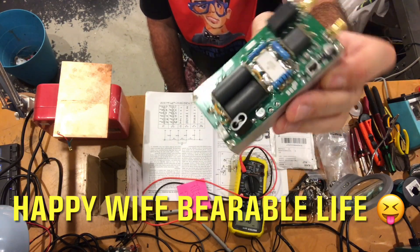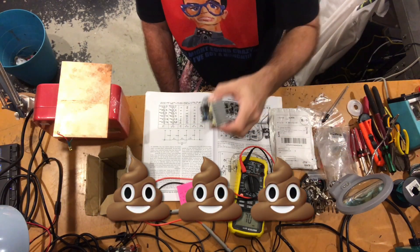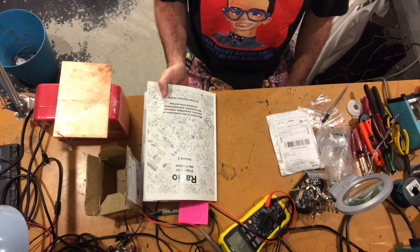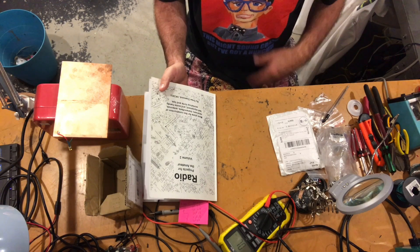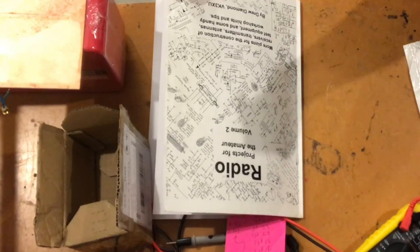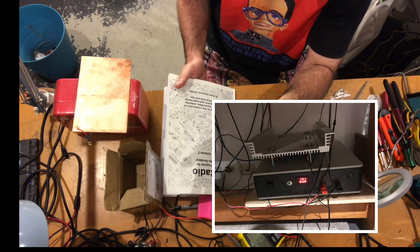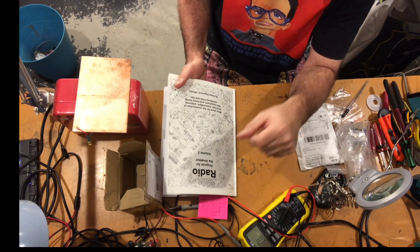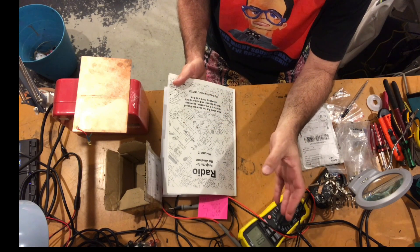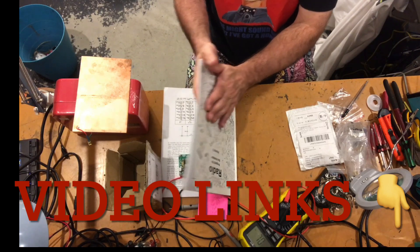This amplifier may be a great buy or it might be an absolute piece of crap. Rather than commit to a multiband build, the plan is to jump into the Bible — Radio Projects for the Amateur, Volume 2, by Drew Diamond of VK3XU. I'll put a link below to the review I did of these books. The shack is powered via his Miser's DC 13.8-volt supply, which has been fantastic. I've shorted it, done dumb things to it, and it hasn't blown up. I've implemented it with rewound microwave transformers — Drew told me about pairing two of them to lower the magnetising current. Drew came to the party and saved the day.